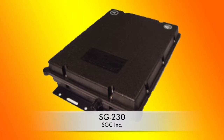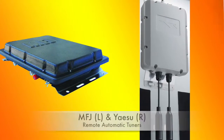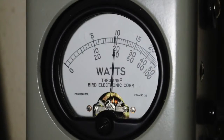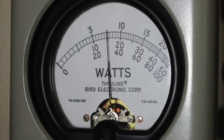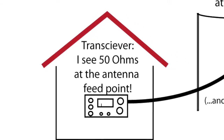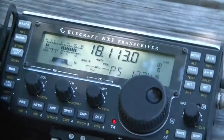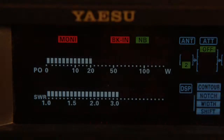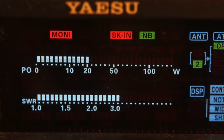This form of HF operation was far more difficult before the popularity of the automatic antenna tuner, especially the BAT — the battery operated auto tuner. Usually the field station is limited to 100 watts or much less, so it is important to have the most efficient antenna possible. Getting all the power available to the antenna is only possible if the feed line has the same impedance on both ends. To avoid extremes in input impedance, your antenna should not be resonant on any ham band.